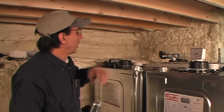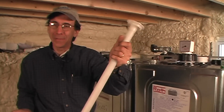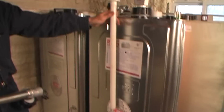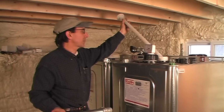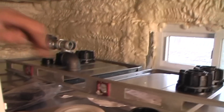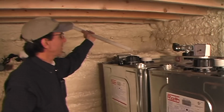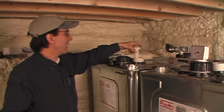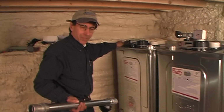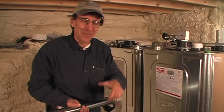No, not quite. We have this. You know what this is? This is the dip tube. I love the name, the dip tube. The dip tube goes in. Now you see how far down that'll go. That's an anti-foaming device. Basically, if we did not have them, the oil would be coming in with such velocity, it would tend to froth and get kind of messy, and it might make a lot of bubbles and stuff and not let the vent work right. So we put the two dip tubes in.